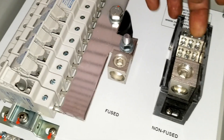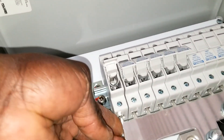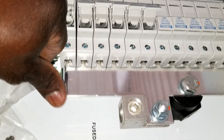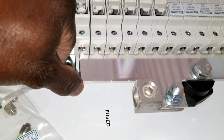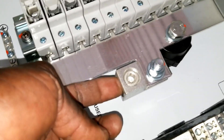This is the bus bar that takes all the DC wires coming in — the negative wires. Each string goes here on the back and they all come together in parallel. It's heavy-duty — it's just like a ruler, that board ruler from back in school. That's how thick this is. Look at this big beefy bus bar. After you get all these things in parallel, there's an output where you can use an even bigger lug.